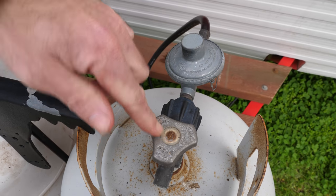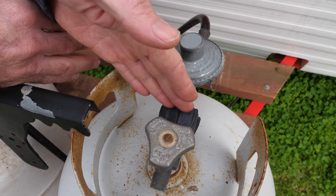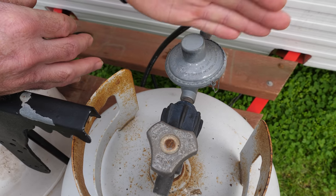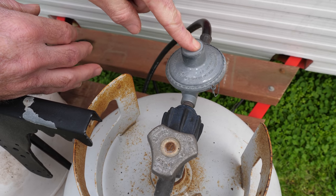When I open up this valve, a little bit of that liquid boils off and turns into gas. It comes out at about a hundred psi — that fluctuates with temperature — but it's immediately reduced down to less than one psi by the regulator.